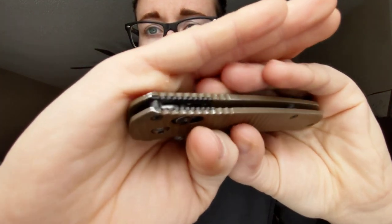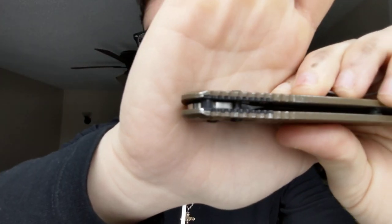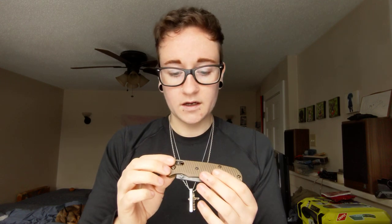So I'm testing literally just how this coating holds up on these and the overall feel of the scales. The Cerakote is wearing off, but I am literally carrying them like this all day long from morning to night - the 940 is purposely rubbing up on the bug out in my pocket, just to record general wear if you were to carry like that, or if you just had anything rubbing up against the Cerakote all the time. We do have some wear. It is not nearly as bad as I thought it would be - I've been carrying them like this for about a week, constantly riding up against each other. This is pretty impressive. This is the coating actually being completely worn down to the raw aluminum. So just as a forewarning: if you get these scales and have something continuously going up against them, the Cerakote is going to wear off.